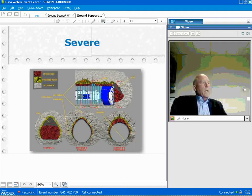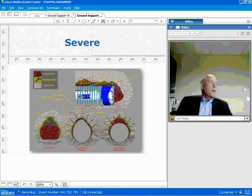Soil against the face. So these hard rock, these good modern HP machines are designed to actually operate with a full face of loose rock against them. We can zero down to 0 to 1 or 2 RPM and just rotate with real high torque and keep advancing with a full face of loose rock in front of it. And at the same time, we've got to contain that loose rock with good rock support.